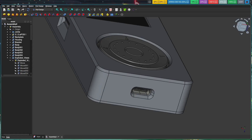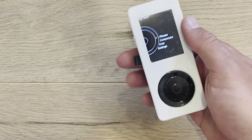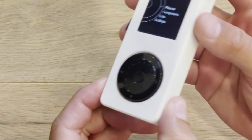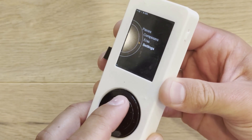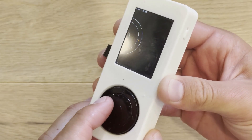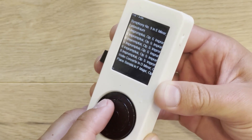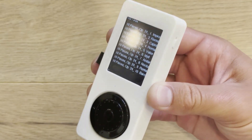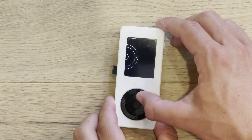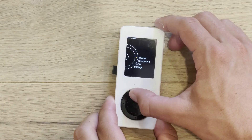Or perhaps USB firmware upgrades — I can do that in the future since the hardware is there. The defining feature of this build has to be the click wheel. It's a rotary encoder sourced from Adafruit, but it's in the form factor of the original click wheels on first-generation iPods. It's super tactile and fun to interact with, but they're super tricky to source because they're not frequently in stock.